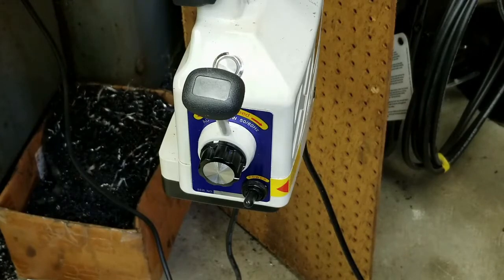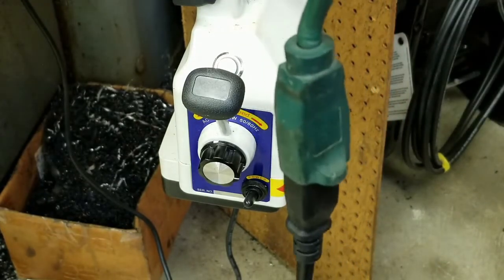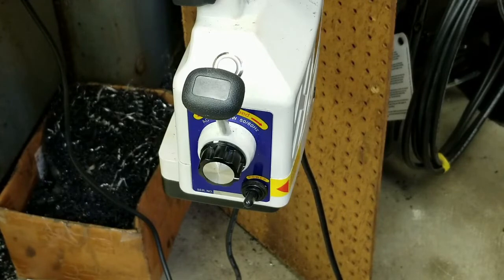You'd think it'd be bigger in the garage, but it's 15 amps — shame on my builder. When you plug it in, it trips instantly. You don't even have to turn anything on — it just trips the GFCI breaker. I tried one of those adapters to bypass the ground, thinking maybe there was a shorted wire, but it still tripped instantly as soon as you plug it in. Something is going on in there. I contacted the seller and they told me to find a repair shop and they'd pay for it — but who's got time for that?